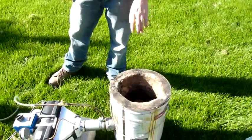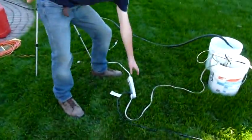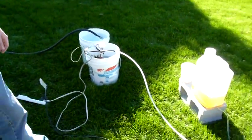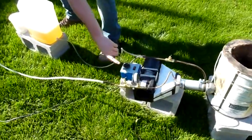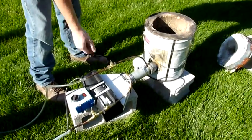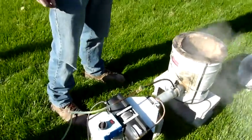For this part I'm going to test the atomizer out just to make sure it's working okay with the fuel. I'm just going to turn on the air compressor and turn on the fuel and see the atomization. I've got the control for my pump over there. Air is on, bleed valve is closed, we are climbing to about 30 psi, and the fuel valve is shut. When I open the fuel valve, theoretically we should be getting a lot of diesel vapor — atomized diesel. That's perfect.